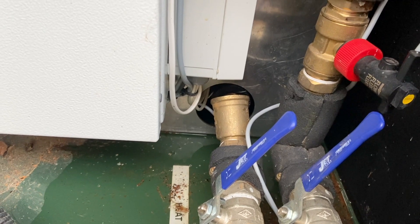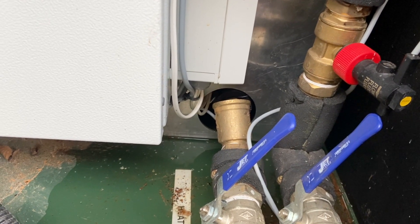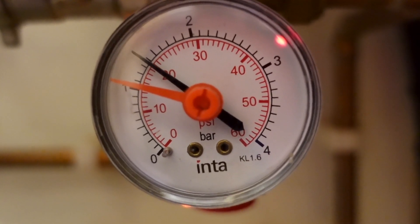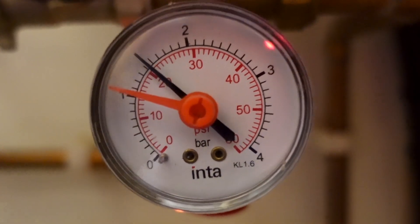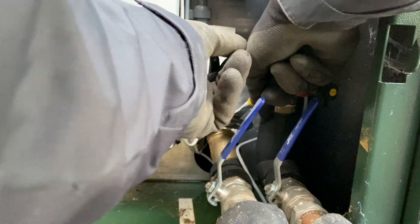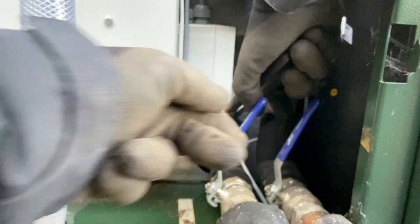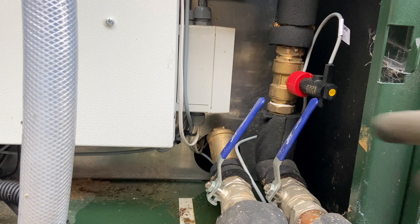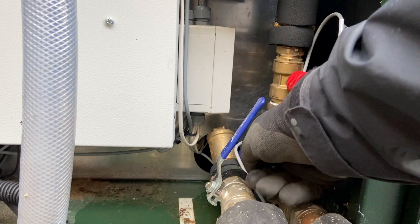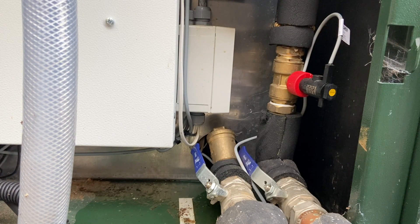What that's now done is hopefully cleared whatever blockages were in there — the water is flowing quite freely now. We're going to pop the filter back in and when it's back in we'll go back inside and top up the water at the expansion vessel so we've got full pressure, and we'll turn the pump back on and hopefully it will start to work again. It's equally tricky to get in there to tighten it and you just have to be a little bit patient because it does eventually seal. So that's it — I've put the filter back in and tightened the nut. Don't forget to open the taps again so we've got free flowing water, and we're going to go back inside and turn the pump on.